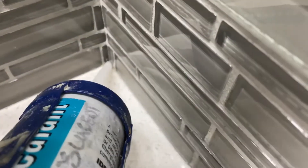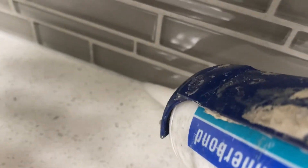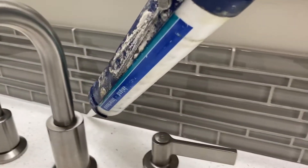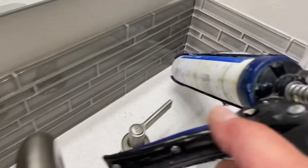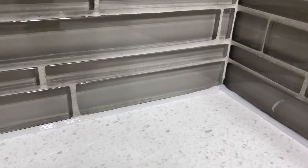We're simply going to apply the silicone. You see how that's at an angle — angle it towards the tile and apply just a really thin bead like this. It's a very thin bead; make sure you're getting it right into that corner and all the way to the end — very thin. Now do this corner as well, nice and thin, steady hands. When you're done, your bead should look like that — nice and even.